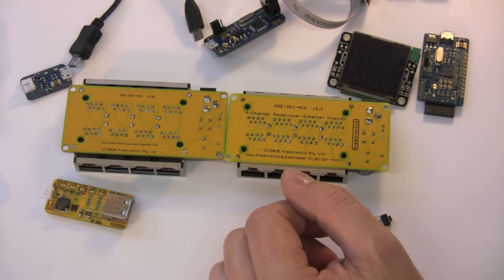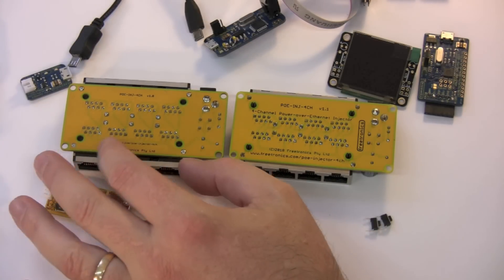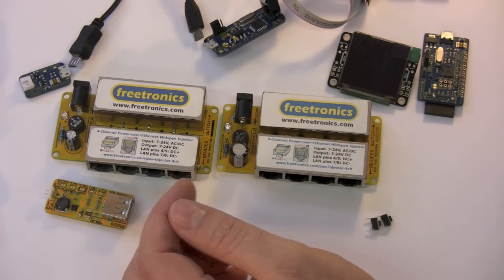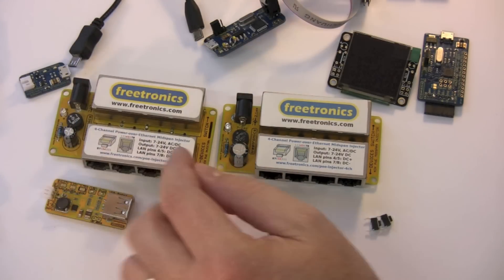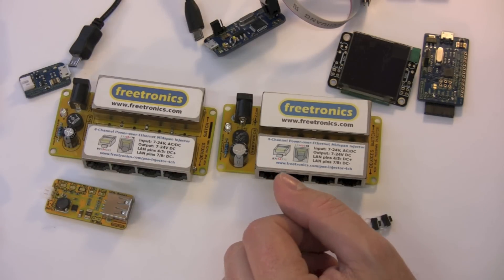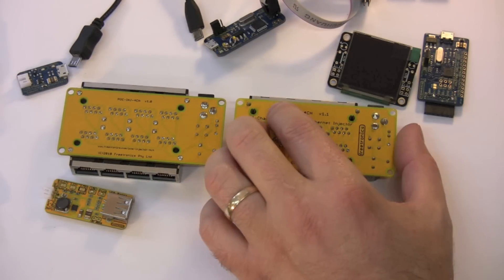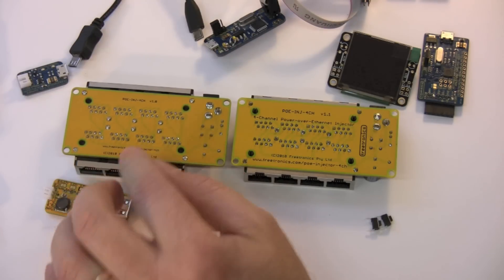This is also showing something else that you often discover only when you actually fabricate a real PCB. I've improved the labels on here, and a lot of the time you'll look at something on the computer screen and think it seems perfectly legible and the text is big enough. Then when you actually fabricate it, you find that labels are obscured by parts that are slightly different dimensions than expected, or text just isn't as big as you thought. In this particular case, I took the opportunity to improve the labels — the text just ended up way too small on this board.